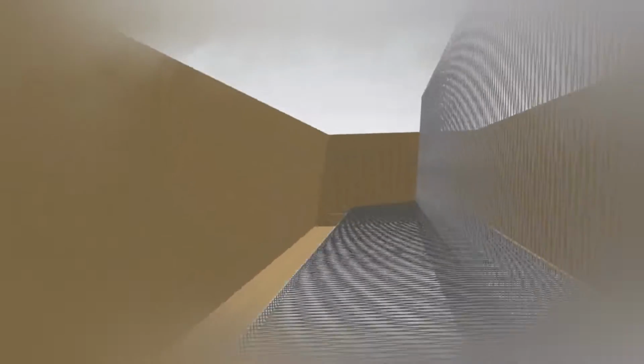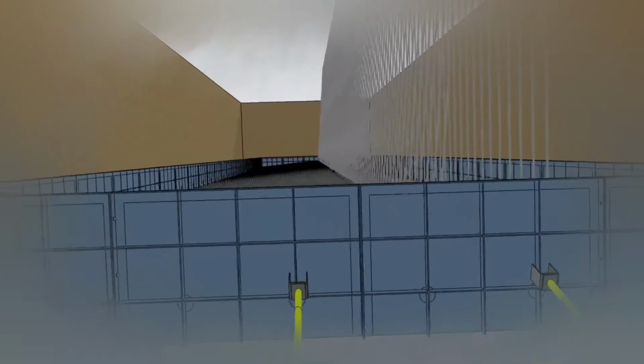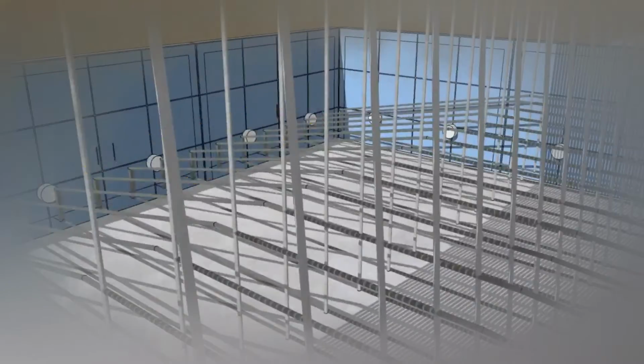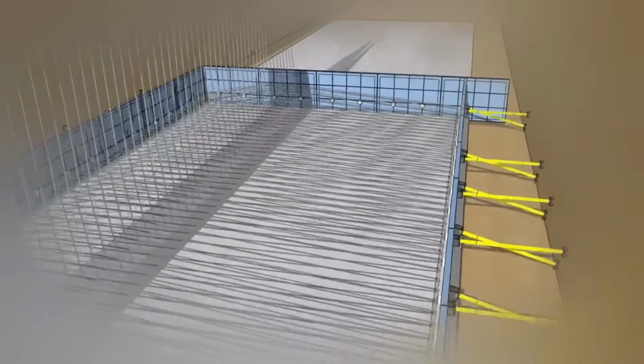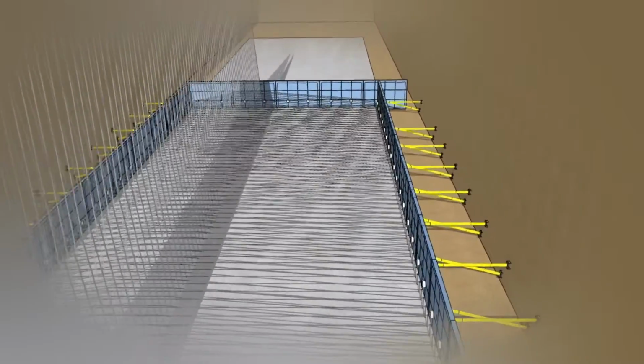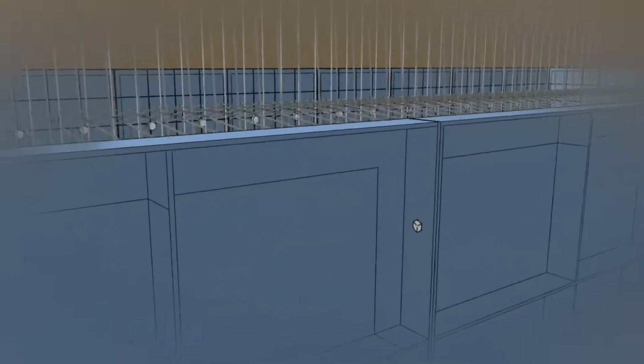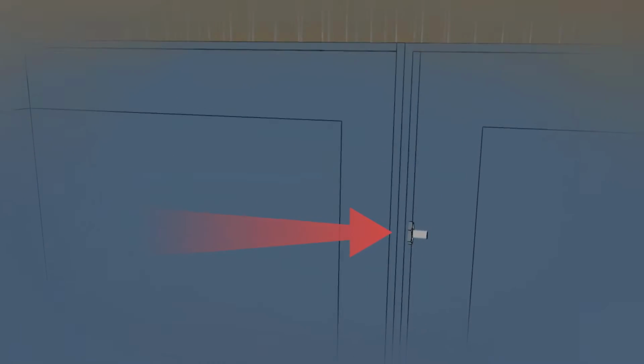After that, formwork material is carried out to the activity location, and it is placed as per drawing details for concreting of retaining wall footing. A 75 mm cover block is tied with reinforcement in between the bar and formwork plates. Formwork plates are tied with the use of nuts and bolts, and plates are supported with U-head jack tecas.